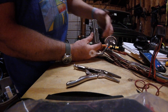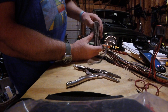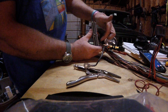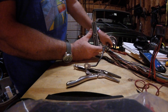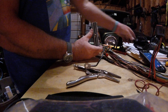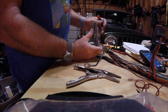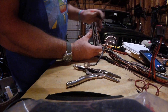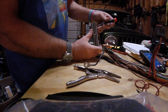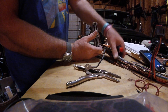You can pick at them and count them. Not all the ports have wires in them — the connector isn't fully wired with sixty individual wires, but there are connectors in most of them. In the next video, we're going to show you how to remove pins from the connector using a small screwdriver, and we're going to eliminate wires 31, 32, 33, and 38, which belong to the emissions wires I was pointing at in my previous video. That's what the next video will cover — removing those and cleaning up your harness.